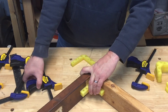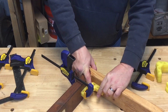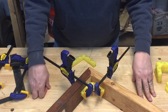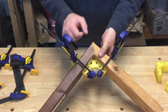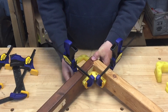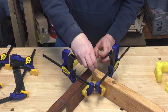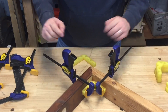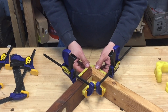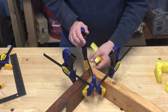That's why I like to put a 90-degree bracket in here of some kind. So I position it like this, bring in a clamp so it clamps to one side of the board, and bring a clamp on the other side. Now I've got a pretty square joint. But because it's only two clamping points and nothing in the center, while I'm screwing the joint it can actually move a little bit, and that's what I don't like. So I'd like another piece in here to hold this point together. I don't want it to drive these two apart like a wedge — that's where I made this other piece. This is what I didn't see with the Rockler version; I wanted a piece here to close this gap and also be at 90 degrees.